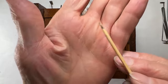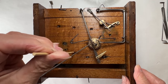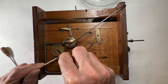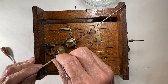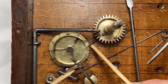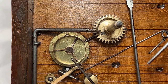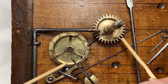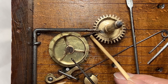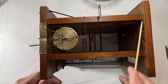Peg these holes out until the pegwood comes out clean. Cock for the verge. Strike control cam — it needs to be adjusted so there is low friction on the control lever. This click lever locks in place for each turn — nice solid lock. Strike control arm bracket. Now to address the loose joints in the frame.